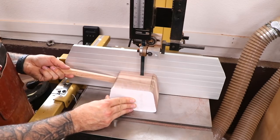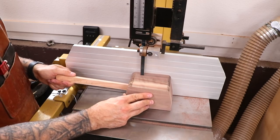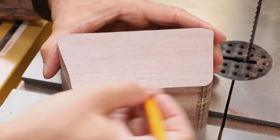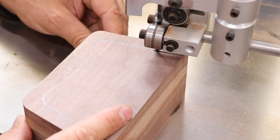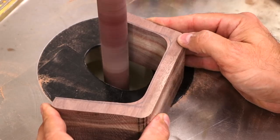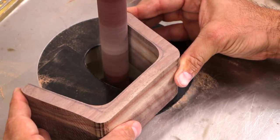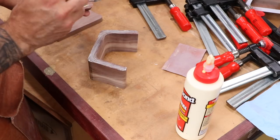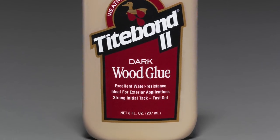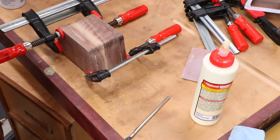Now let's make the drawer. Start by cutting off the back of the drawer blank, then cut off the front. Make sure you keep these pieces in order. On the remaining blank piece, draw a half-inch line around the sides and bottom to mark out the drawer cavity, then cut it out. Smooth the inside however you can, as this won't be easy to do once the front and back are glued back on. By the way, I'm using Titebond Original for this glue-up, which tends to leave a light colored glue line. Titebond makes another product called Titebond Dark Wood Glue, which is a great choice for woods like walnut, especially on a project where we're trying to hide joints. This project was just a practice run so I wasn't too worried about it.